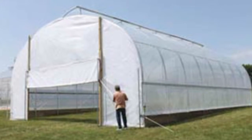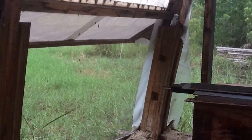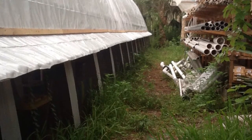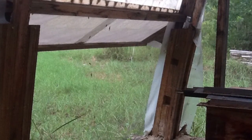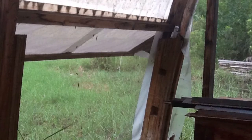So we stopped that and we started looking at sawtooth greenhouse designs where continuous air flow exists. I started by adding three foot screen vents continuously along both long sides of my greenhouse. Because my greenhouse was already built, I didn't want the water running on the ribs, so I added a little roof out over the three foot vent to keep the rainwater away from the wooden ribs, attaching it at the purling at the three foot high mark on every rib, and then connecting those with a one by two. That gave me something to connect my polyethylene sheeting to.